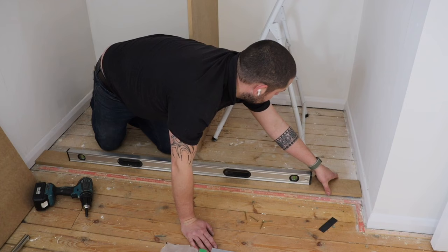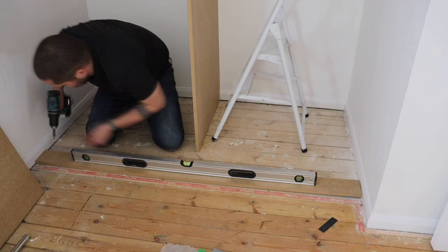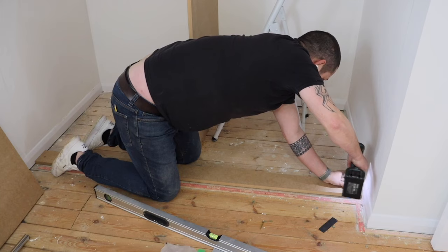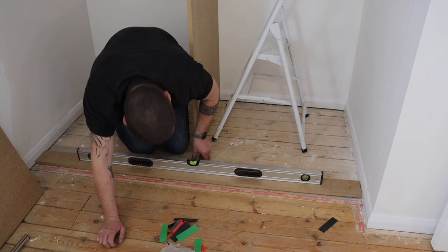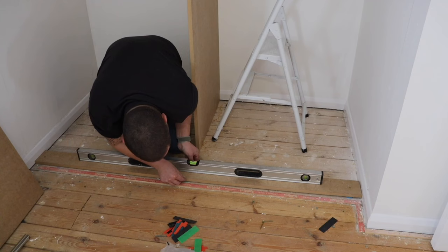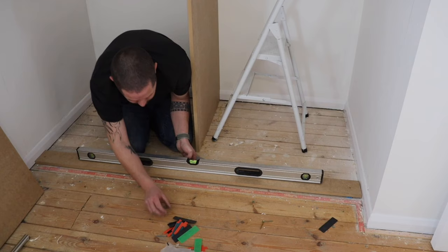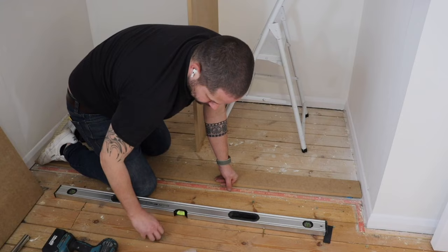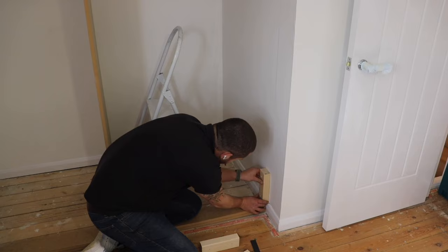It was about 10mm out of level over 1500mm, which is quite bad. I actually doubled up the base strip as well because it's going to be taking carpet either side, so I wanted a really nice positive stop for the carpet. I then did quarters and put packers in — because of the weight of the doors, I wanted a really strong point for them to sit on and didn't want it bowing over time.